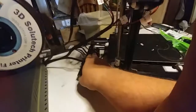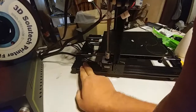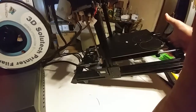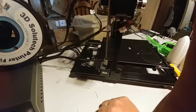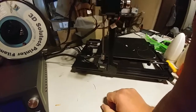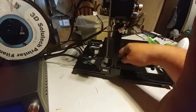I would also suggest tweaking your Y carriage stepper motor — this one's very easy. Just take out the four screws and turn the motor 90 degrees so that the plug comes out to the left. This way, if you work on your printer, you're not pushing your molex connector into your table. It protects that molex connector. This should be done from the factory. Hopefully they'll see this video and add these corrections to QC, because all they have to do is change the way they assemble it.